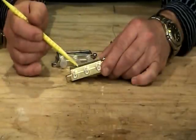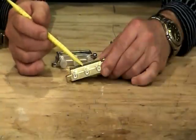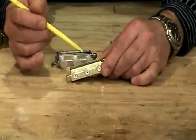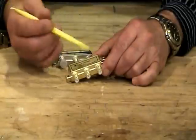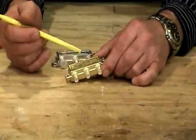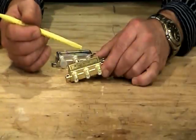These splitters were really designed back in the 50s or 60s, good really when everything was analog only. They won't really pass digital channels very well, so there's one strike against them. Plus these are not bi-directional, and today in a cable TV system signals must pass both ways through the devices so your set-top box, your modem, and things like that work properly.